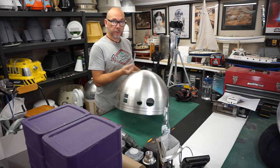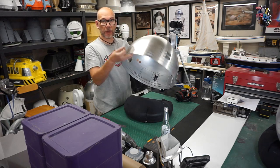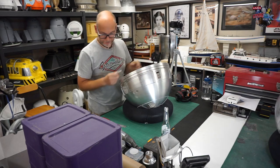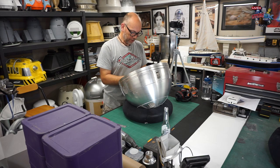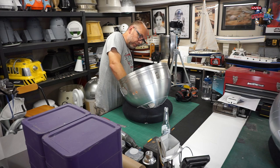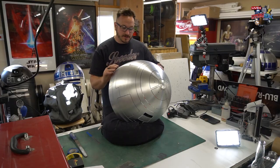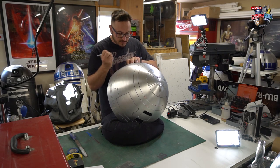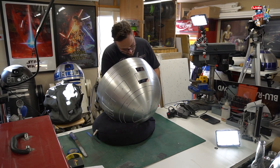So what I just realised, because of removing these panels from the dome, I am going to number them myself as well to keep them corresponding with the same. They should all be the same size on the R2 dome, but with aluminium, just in case. With aluminium, you've got to remember you shouldn't use a pencil. Correct. Because it corrodes. Yeah, so we're using Sharpies.